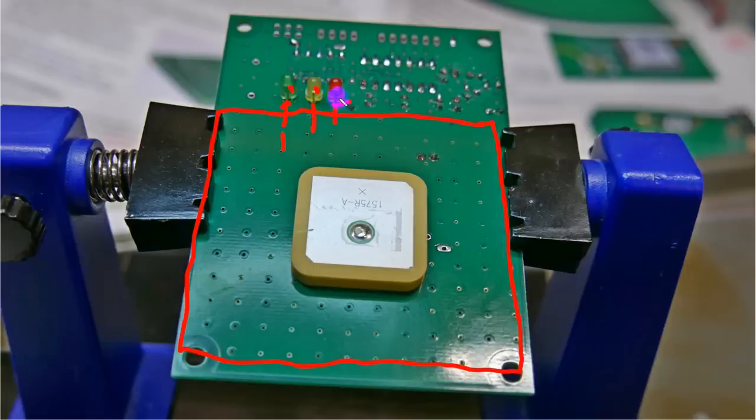So you'll see the red shining all the time. You'll see the green pulse once per second, and right after the green pulses, the yellow one comes on for a little bit while it sends that data word down. The baud rate here is 9600 bits per second. It's not very much. It doesn't need to be very much.